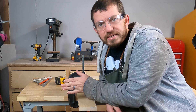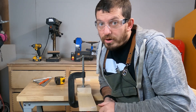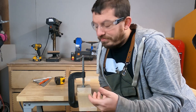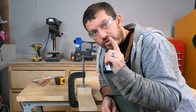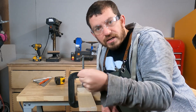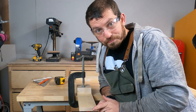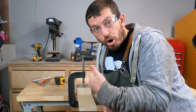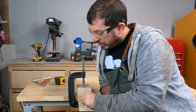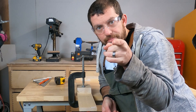I have an old saw I use basically just to finish off stuff here and there without chipping. I've got a C clamp — not expensive, helpful to have in your toolbox. And just to get you in the habit of not damaging your projects, I have a scrap piece of wood here, because if I tighten it too hard — this is pine, really soft — it will mark. This will not mark it. I'm going to show you how to use a handsaw perfectly straight every single time.